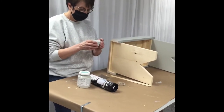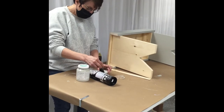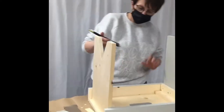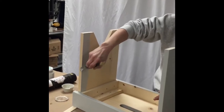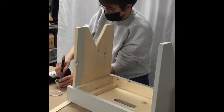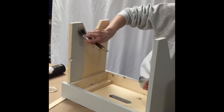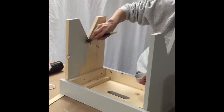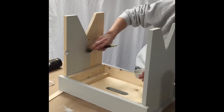You're going to get paint in a little dish like this and you should also have a paintbrush just like this. Dip your brush in and wipe off any excess so that you don't have any big blobs of paint. I'm going to start on the inside of this bench and just go from the bottom to the top. Sometimes when you get these big knots you might actually have to kind of push your brush in there. This paint dries very quickly so you don't want to go back once you've already applied it — if you see a run, don't go back because you're going to get lines. But this color has very good coverage; you can almost see that you don't even need a second coat, but we did put a second coat on this bench.